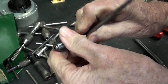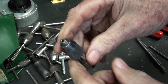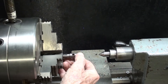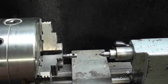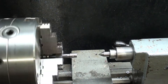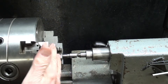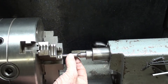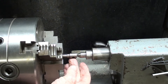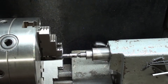Before you hold this in the lathe, tighten it up all the way so it will not go any farther, and then remove the handle. All I'm going to do here on the lathe is hold the knurl in the chuck. Now, the problem with this is it's not going to run very true — it's wobbling a bit. Here's how we'll take care of that: just bring the tailstock up, tighten down your chuck again, and you're ready to turn. This is currently 500 thousandths, and you want to take it down to 7/16ths, which is 437 thousandths, so it's a real simple turning job that takes about one minute, and then you're ready to install it in the handle.